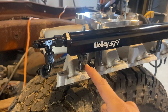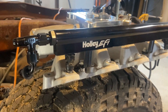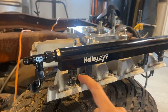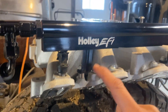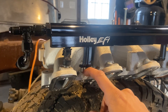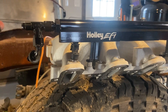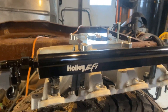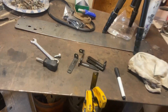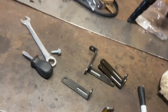My main thing is to get this to sit as low as possible, but with the way I have it now this ring would usually sit down on the front of your throttle body and I have a good two and a half inches. So if you buy these — this is a Holley single plane intake — instead of buying around six hundred dollars worth of injectors, I want to use my truck injectors that were in there before. The height is different on these so the small bracket the fuel rail comes with is about three eighths of an inch too short, and the other one is too tall.